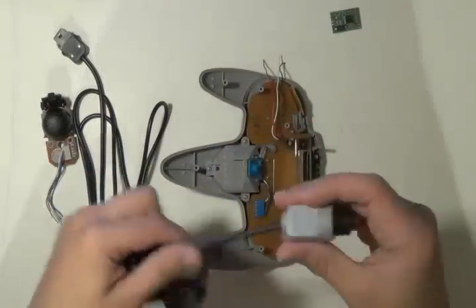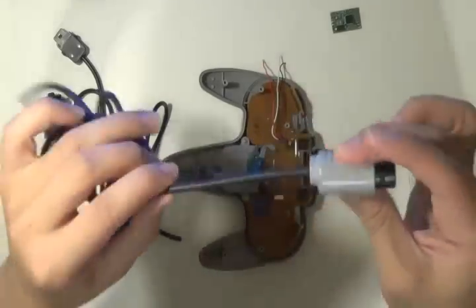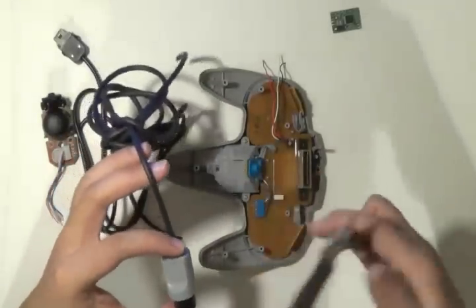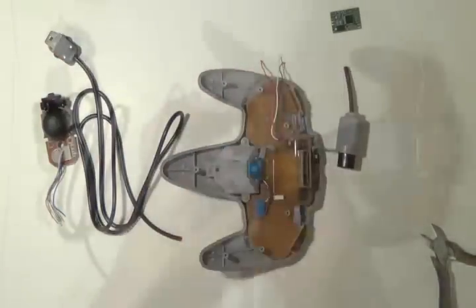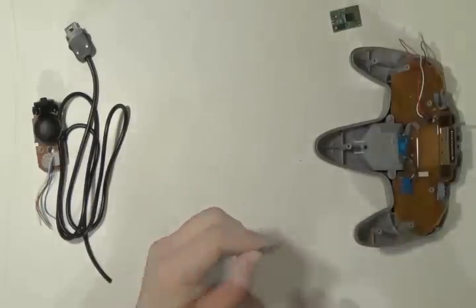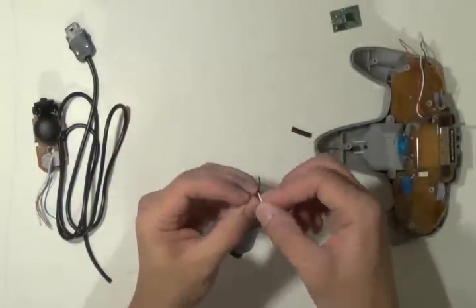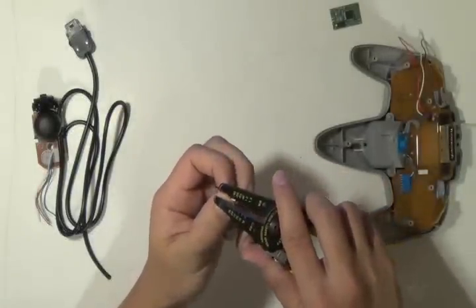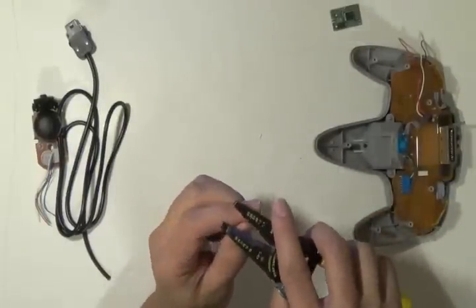Now, I would much rather you try to use the original connector as a reference. So what we're going to do is cut this off and try to open it — you can discard the wire. What I want you to do is strip it so you can see all the wires. There are actually two different ways to do this. We can strip all of the wires like I'm doing now in the video, and you can tell which wires go where by using a multimeter and doing a continuity test.